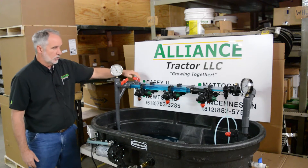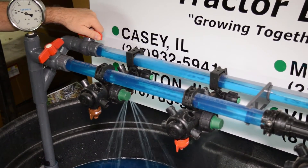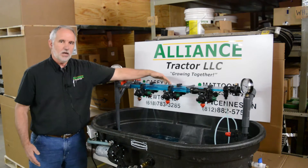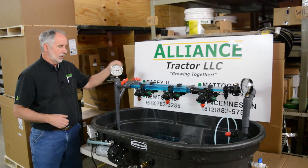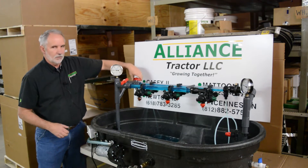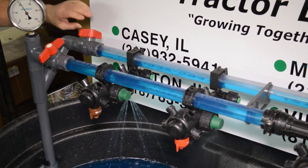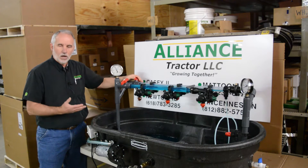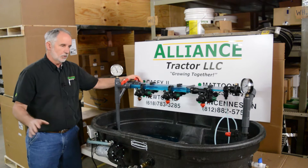We're going to show our traditional boom. We turn this boom on. If you notice, there's a little bit more of a delay for that boom to start up, and there's trapped air in this boom. Trapped air is compressed, and that's what affects that turn on and off time. And if you notice when I turn it off, how long that body takes to shut off — you get a little more dribble and spray out into the crop.